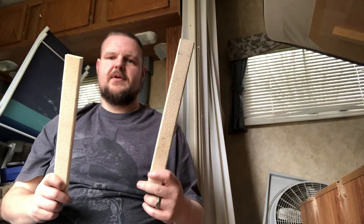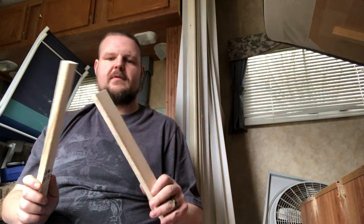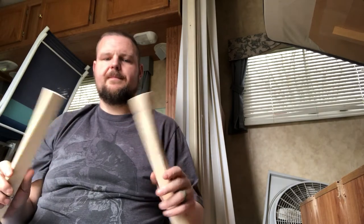Okay, guys, so obviously I have to put some more bracing in for this bed because I cut a large chunk of it out and there's not that much to start with. So I got some trim pieces here. That's one by, I think it's one by two. I got it cut to fit. And the way we're going to put it in there is with pocket screws.